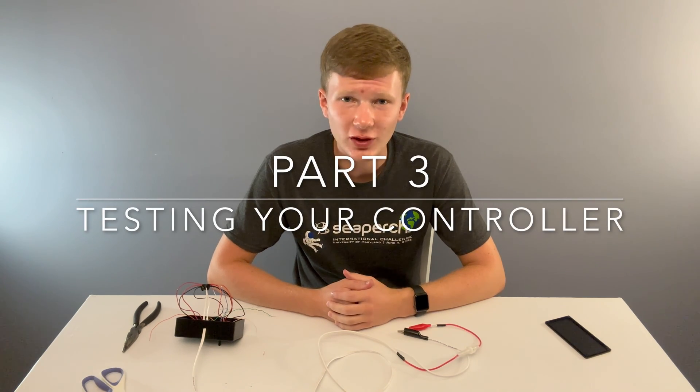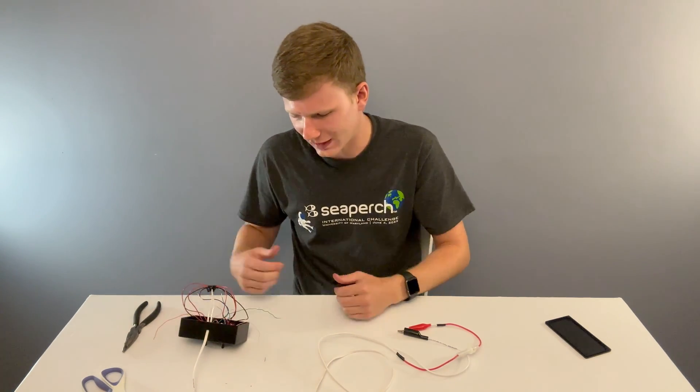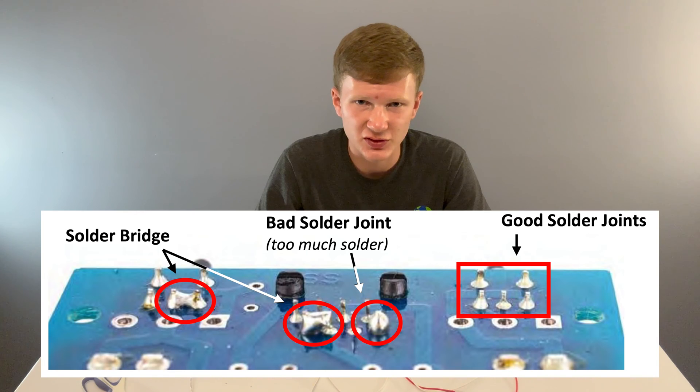Alright, you've made your controller — now it's time to test it. Before you do, it's a good idea to go back and look through your controller to make sure there are no accidental solder bridges. Double and triple check this. Also, for all of you who built your controller from scratch, make sure all the ends of your colored wires aren't touching by pulling them apart. There are two ways to test your controller. One is with a digital multimeter, and the other is just trial and error. The multimeter negates the need to replace your fuse if there is a soldering mistake, as you can test your controller without the fear of breaking it. Take your multimeter and turn it to the continuity setting — it should display a 1. Touch the prongs of the multimeter together — it should read 0 or close. Connect the alligator clips to the prongs — it should still read 1. If it doesn't, there is a short circuit somewhere. Stop and recheck for solder bridges. If it is still 1, you can continue testing. Press and toggle each of the switches one at a time. Because the motors are not hooked up yet, there should still not be continuity when you activate the switches, so the multimeter should continue to read 1. If it doesn't, stop and recheck the entire controller for shorts and solder bridges, as a problem on one switch can cause another one to make the multimeter go off.